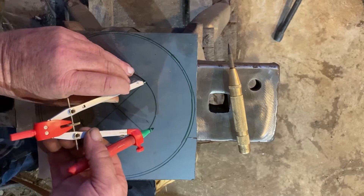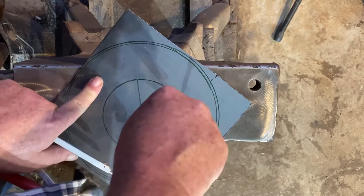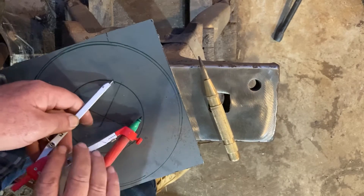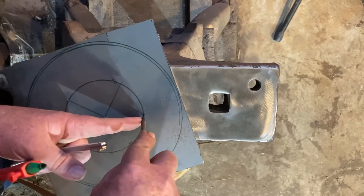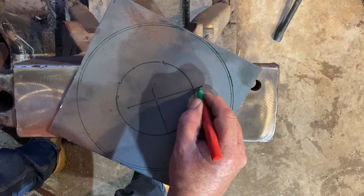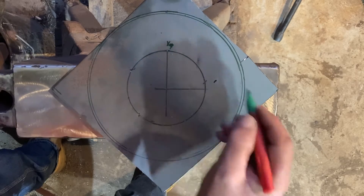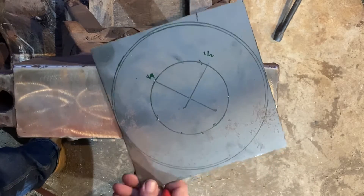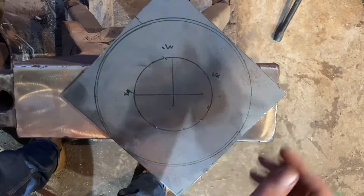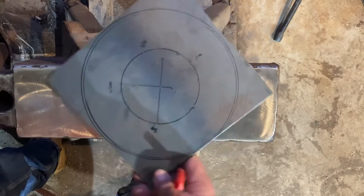This will be near enough for government work. That gives me five roughly equally distant holes. We're going to start with a quarter inch — six and a half mil — then half inch, next one's going to be three-quarter. These ones I can drill because I've got those drill bits, and the last one is a one inch, which basically takes me out to the full size, and then I'm going to have a slot.